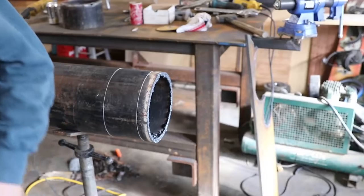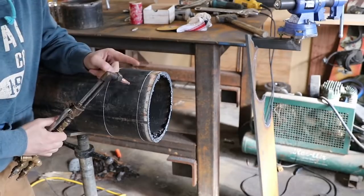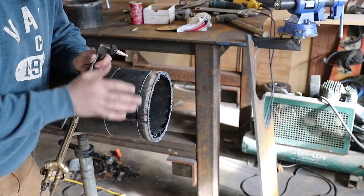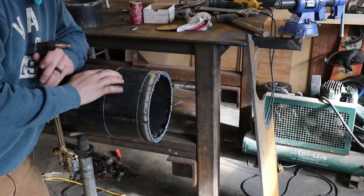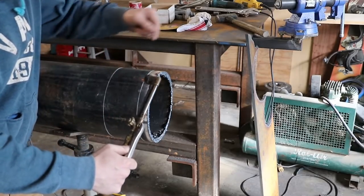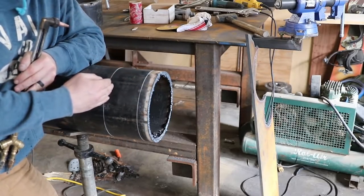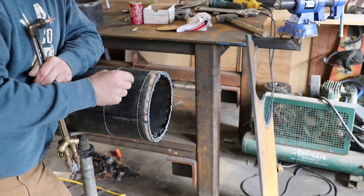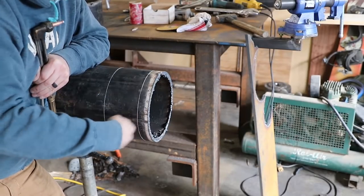Now, when you guys go to cut this piece of pipe, you have to be super conscious of what this tip is doing. My suggestion is you would rather have it be long going away from the piece that you're gonna keep. If you're cutting into the pipe, you gotta grind all this material back, for one, and it's just a ton of work. And for two, now you're a 1/4 inch small because you cut it backward into where you wanna be.